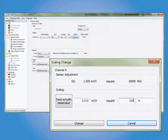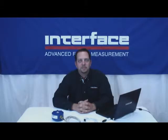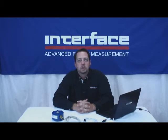If you're using the INFUSB with an existing sensor, simply enter the desired display units for a given input. There are also options here to assign decimal resolution, output polarity, averaging, and sampling rate. INFUSB modules can be scaled again and again for different sensors. And given that calibration data is stored on the hardware and not the software, multiple modules can be used on a single PC with plug and play ease.